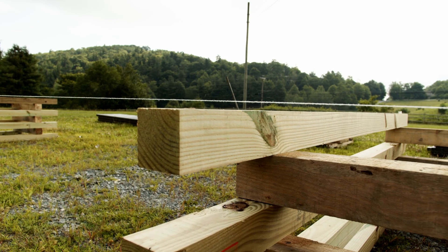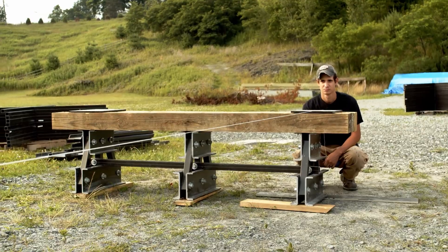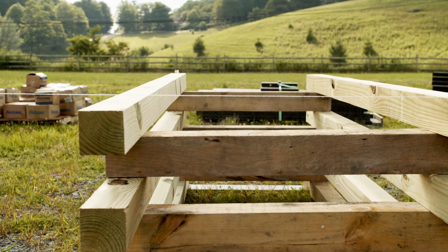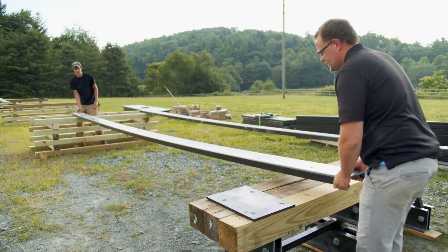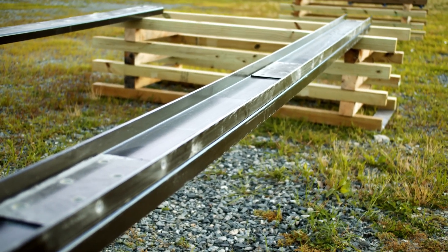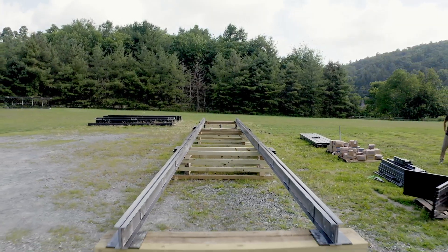Note that we are verifying our straight line from the top of the FRP bearing pads. Because each bridge is built with a positive camber, shims or spacers are going to be required to add this camber. However, at this beginning stage, we want the supports to be in much of the same plane as possible. This camber will be added later during the process.